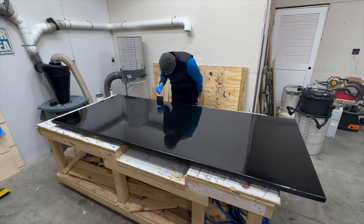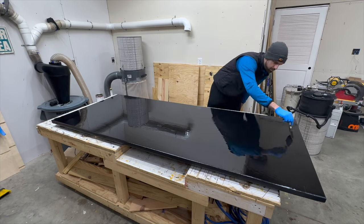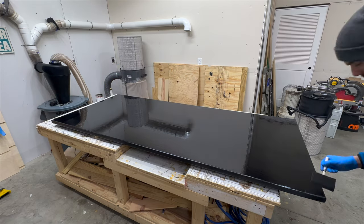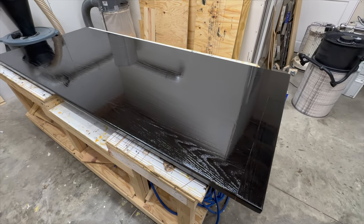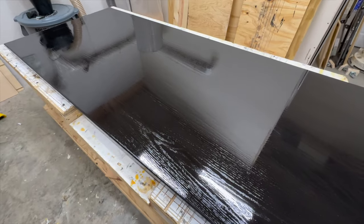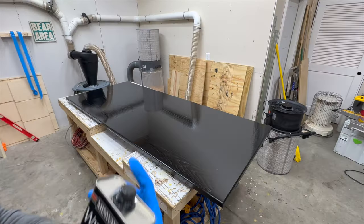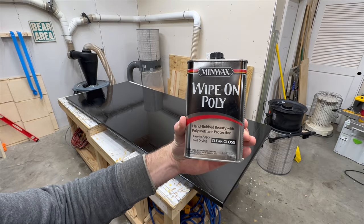It's really up to you how many coats of polyurethane you would like to do. I recommend at least three — probably any more than four isn't really necessary — and you're going to do this process the exact same way as that first coat of poly. You'll find that each additional coat makes it look a little bit better than the last. Here's a closer look at the second coat, a substantial improvement from the first, and you repeat the sanding and mineral spirits process in between each coat.